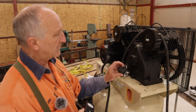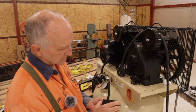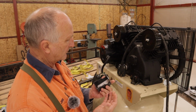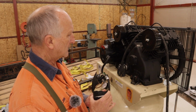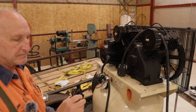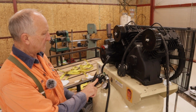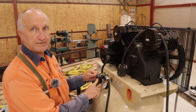Here's the guts of the original switch. It's a Hubbell Industrial Air Power. I'm reading the label on this one. It's the same, 240 volts, 26 full load amps, and 130 starting current amps, I guess. Well, I did some troubleshooting. It wasn't hard. I don't know if you can see that or not, but this contact is welded. Now, this was like this. I could run the switch, but it wasn't turning off. That's why I had to unplug it.